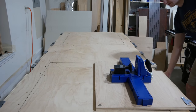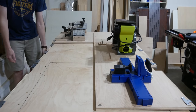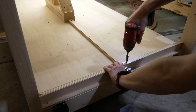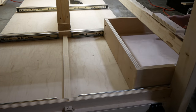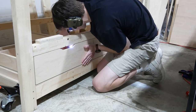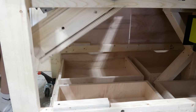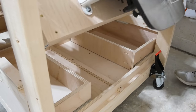I'm done mounting all my tools to the flip-up panels. In total I've only mounted three tools and have three spaces left for future bench tools as I build out my tool arsenal. I added a simple frame made from strips of scrap plywood for the drawer slides to mount to, first screwing a strip across the 2x4s underneath and then adding notch strips across the first. Then I mounted the drawer slides to the sides of the notch strips and slotted the drawers in place. I pressed the drawer faces on the front, aligned them, and screwed them on with pocket holes. Depending on what tools you mounted on the rotating tops you may need to adjust the height and depth of your drawers — the scroll saw comes close to the bottom so I made those drawers shallower.